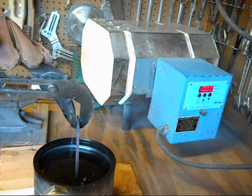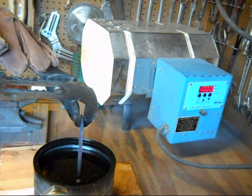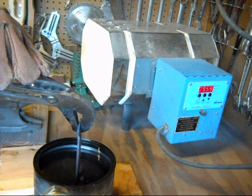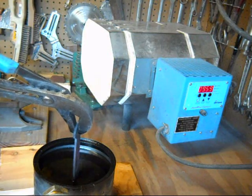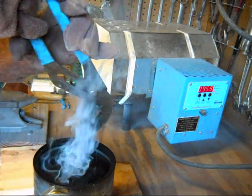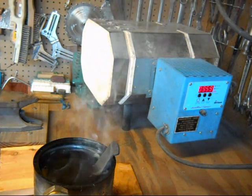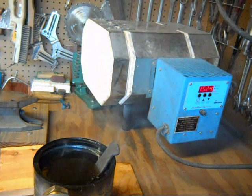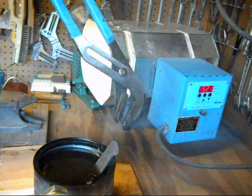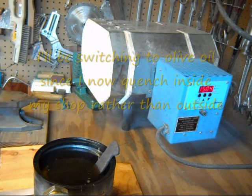Now this processes the hardening of the steel, and after I get it cleaned up, I want to take some of that hardness out so the knife's not so brittle. It's cooled enough where I can just let it sit and cool on its own. Sometimes you get a big flame when you do this, sometimes you don't. For the quench, I'm just using old used motor oil.